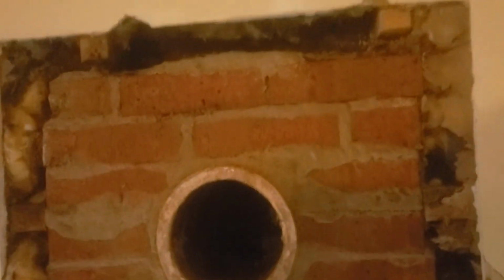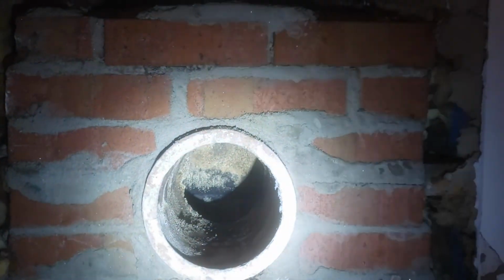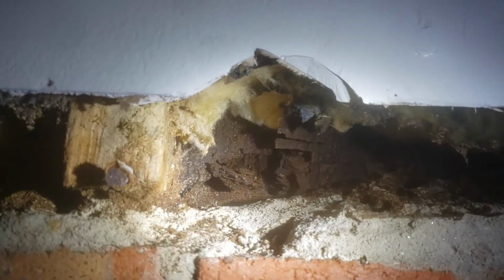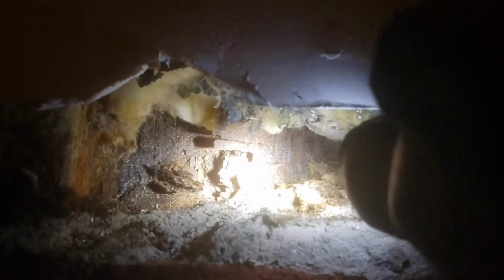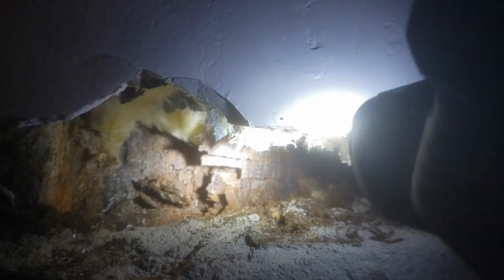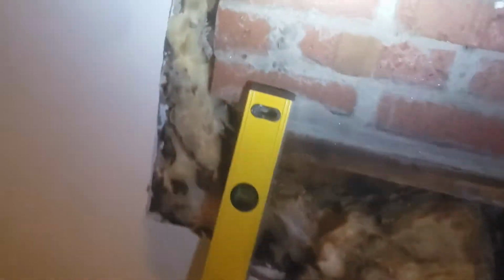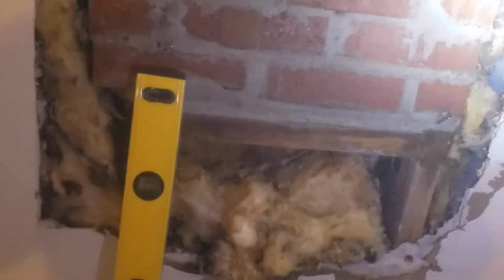Bad idea. We have the chimney, and inside is so much moisture. What I thought had been some amount of plaster or something surrounding it was actually just all destroyed drywall. So this is what I imagine is the sheeting of the house behind the outdoor chimney. Water rotted through. Drywall up here, still dry. You can see there's some nail pops. Water damage around it for sure, and then it kind of stops down here. So somewhere water was getting in behind this chimney. So I'll be looking to fix that, but all this has got to come out.